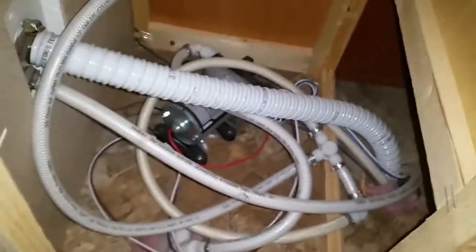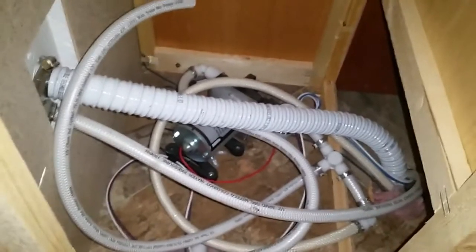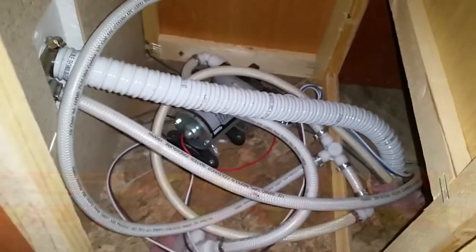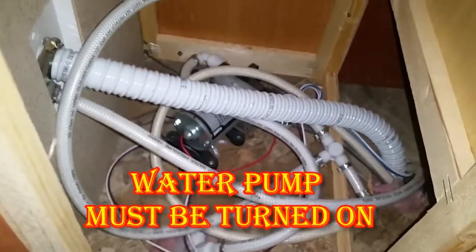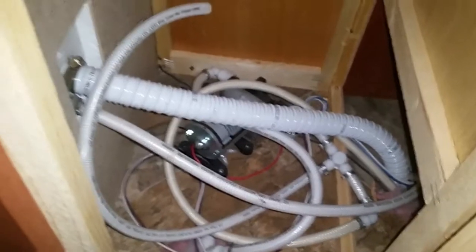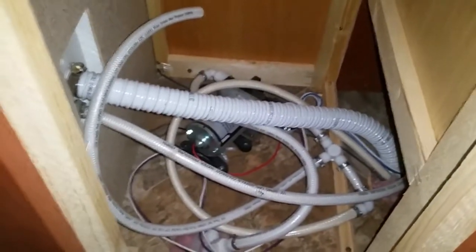And of course you just go and open up your faucets till you see pink coming out, and every one of them, even the outside one, you do that, and then later you add antifreeze to your drain P traps.